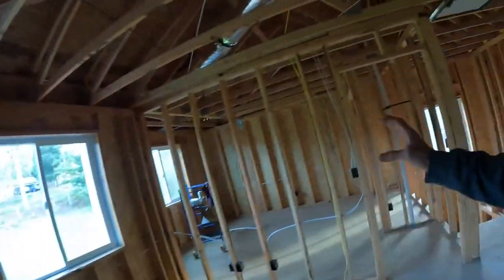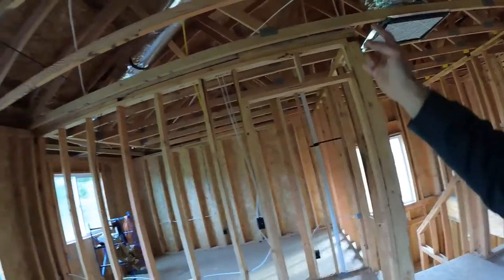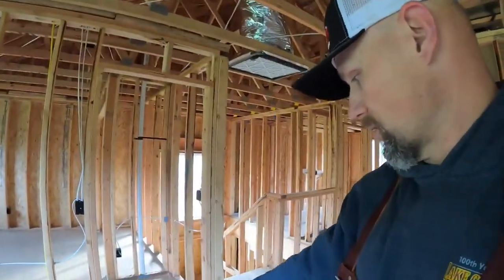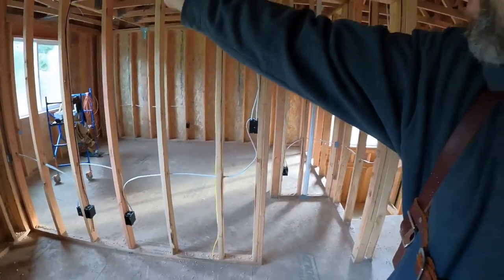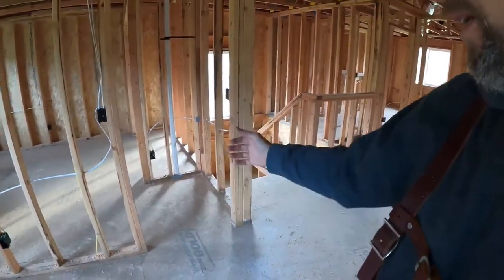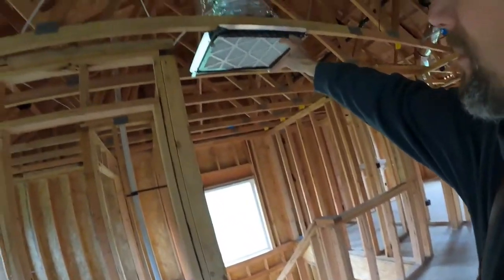So it doesn't have a chance to really cool the room before it gets to where the supply is. Here's the door — kind of an important point for balancing purposes. Air comes in, and as I said, it has to be balanced. It's going to come underneath the door. So having a path for that air — if you think about the volume of air coming in and going out when that door is shut — there should be a gap underneath it, and then it follows back up into the return.